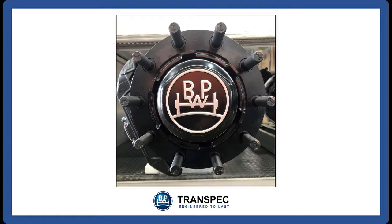Available in Australia from 2018, the Eco Plus 3 hub operates on the same tried and true principles as the BPW Eco and the Eco Plus hubs, with some refinements. Using the same bearings and grease shields as the Eco hub and Eco Plus hubs, the Eco Plus 3 adds improved sealing to the design. Once again, the Eco Plus 3 hub design allows you to remove the hub from the vehicle without having to dismantle it.